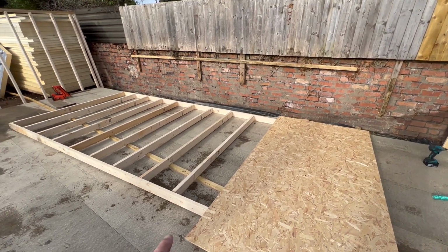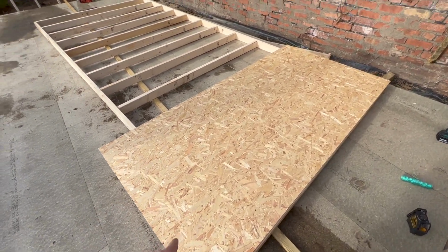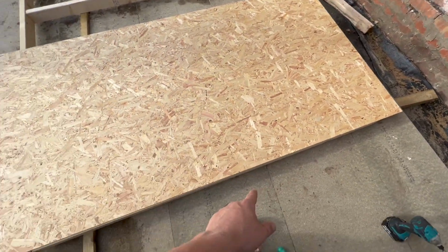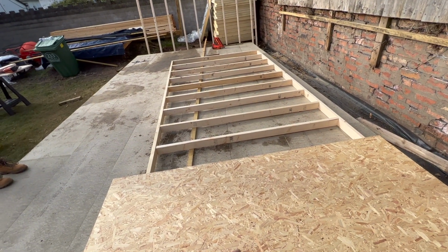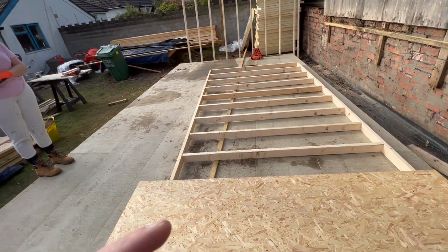We've got most of our back wall ready. That's the bottom end, this is the top. We're going to do a bit different to how Liam does his. I'm going to overhang the bottom, pin it all along level, then square up the side. As you can see, it's not square at the moment. Square up the side, and then once I've done one, I'm going to lop it off. I'm going to chuck the wall up because I'll keep it square for now, and then I'm going to board it afterwards, only because it's just me and the wife, and I really want to get the roof on today. So I'm just going to try and chuck the walls up temporary, chuck one board of OSB in the corners to square it up, brace it all, make sure it stays fairly square, and just temporarily get the roof on, so we can get the OSB up.